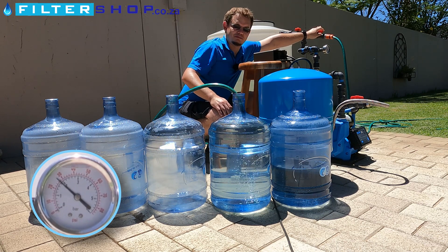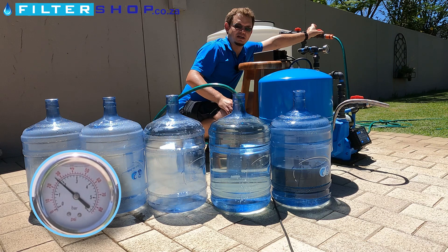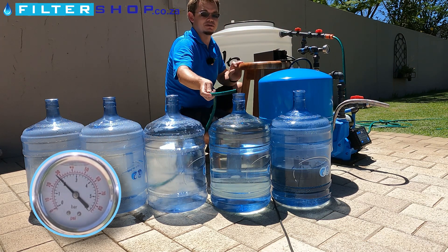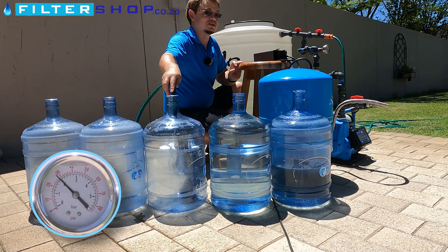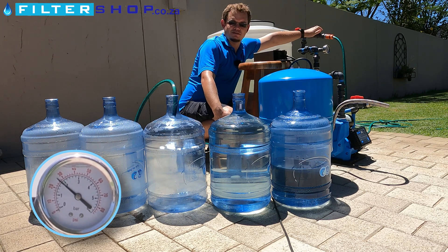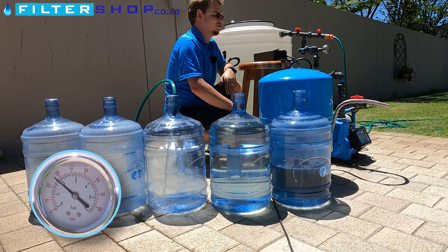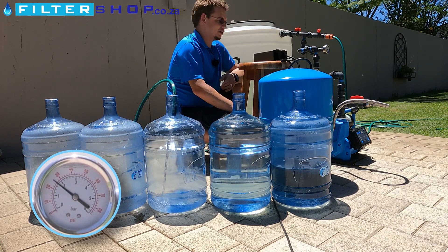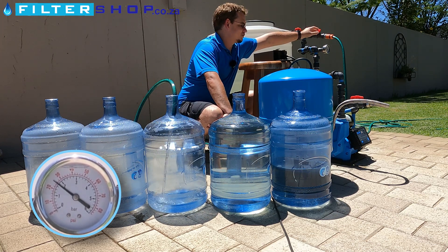For example, as a sanity check in my own house, I actually found out that if I've had two showers running, my pressure drops to 2.8 bar anyway. So anything above that is still okay for having a decent shower, though that will vary a bit from time to time.